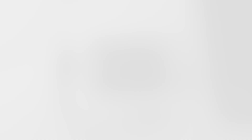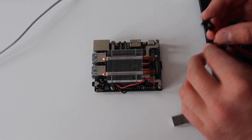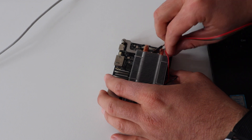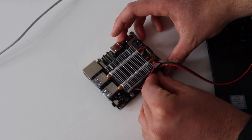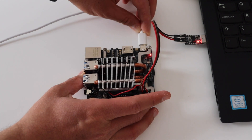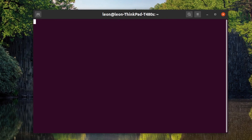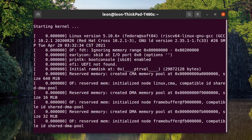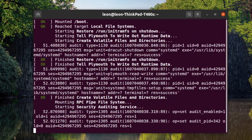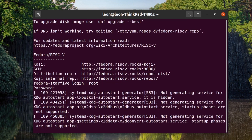You can log in through SSH or over a serial connection to the Fedora image booted on BeagleV. I'll be using a USB-to-UART debug cable to log in over serial connection. Connect the ground of the cable to a ground pin of BeagleV, connect Rx of the cable to pin 8 of BeagleV, and Tx of the cable to pin 10 — essentially crossing Rx and Tx. A USB-C power supply providing 3 amperes at 5 volts is recommended. The baud rate for serial communication is 115200, and I'm using screen to interact with the board through UART. For this Fedora image, log in as root with the password "starfive" — the same name as the CPU brand.